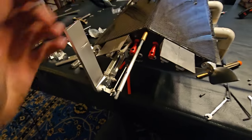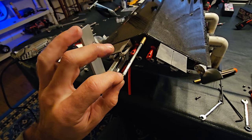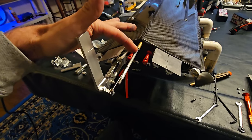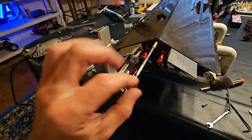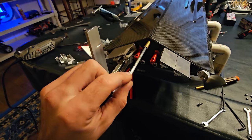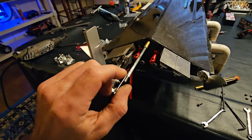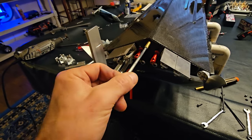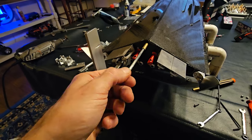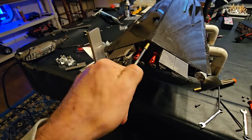I understand how that fatigue happened — he probably tried to trim it flat, which causes that stress. I already cut mine off about three-eighths of an inch, which gives me a little bit of play. I measured it with a micrometer to where my flex shaft gets a little bit of play, because before it was so rigid it was almost to the point where you didn't even need a flex shaft — theoretically it was straight through. I thought, can you run piano wire?